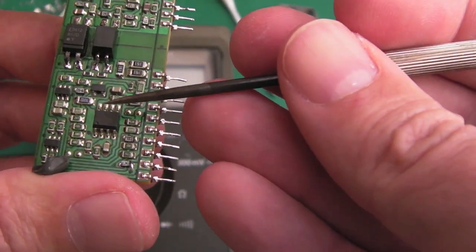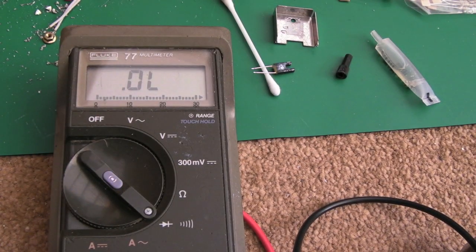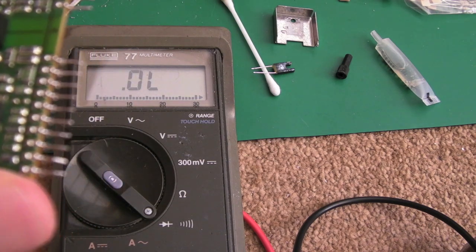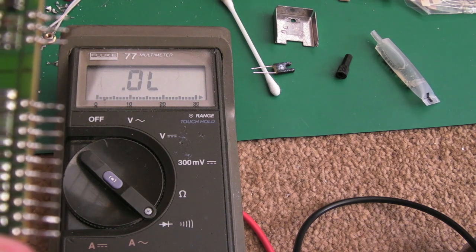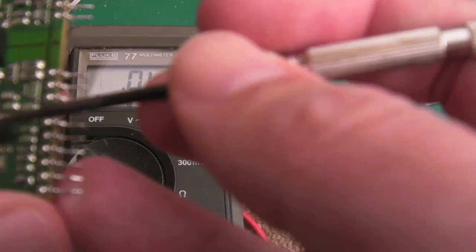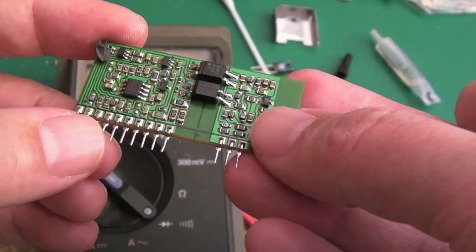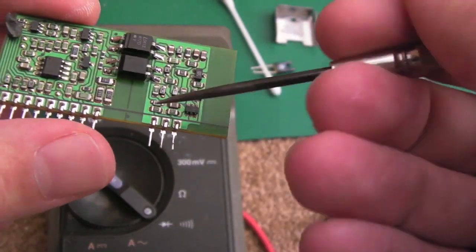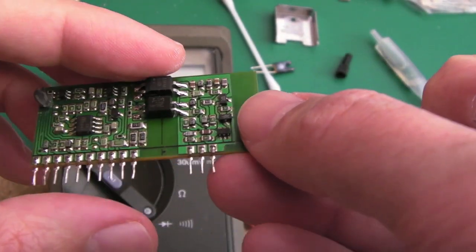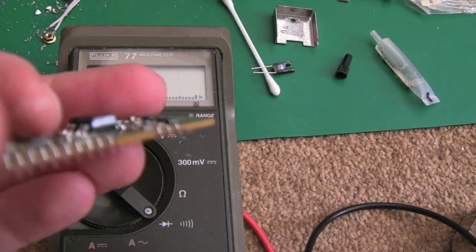And then we've got that little chip there that I've not looked up yet either. Let me just see what that is. Yeah, it's marked ST3936, and then underneath it says 644. So I'm not sure what that is. Is that a 393, like some sort of comparator or something? You'd think so, in the position on the board it's on. And then just a few transistors. So anyway, I'll straighten up the pins on that, reassemble it, wait for the transistor to come, and I'll show you once it's all reassembled.